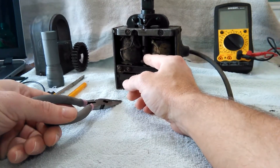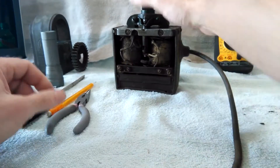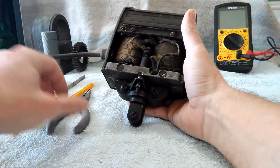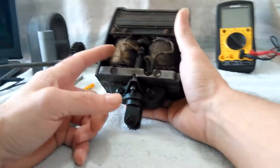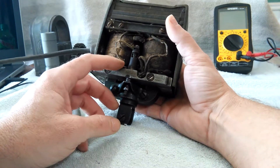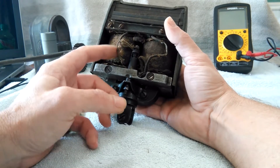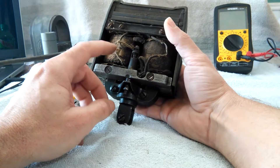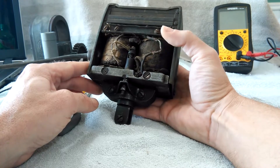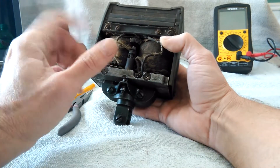You can use wrenches to get in here and get on this nut. When this mag was still mounted on the engine I wasn't getting any spark. The front cover wasn't on and I also see that the wires here are frayed — or somebody actually cut the covering off. This one is like this and this one over here is like this; it almost looks like somebody tried to bypass the possibly bad coils.